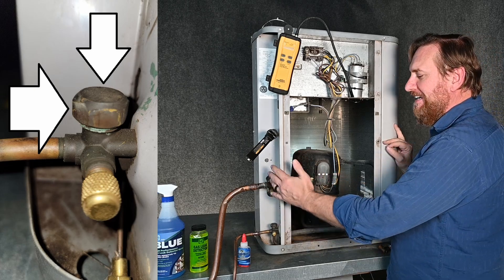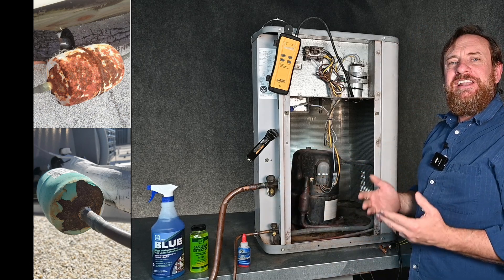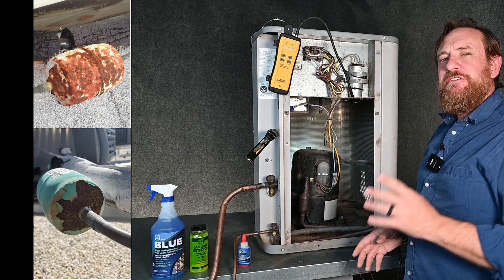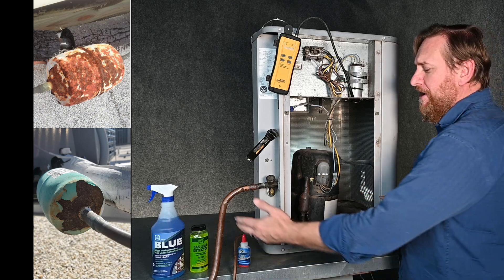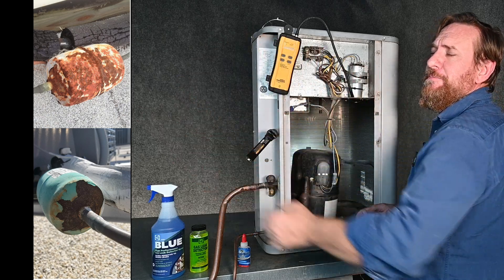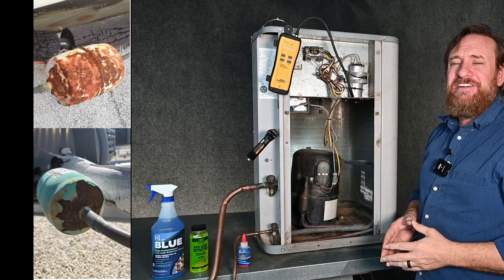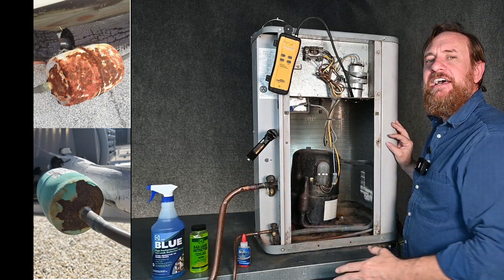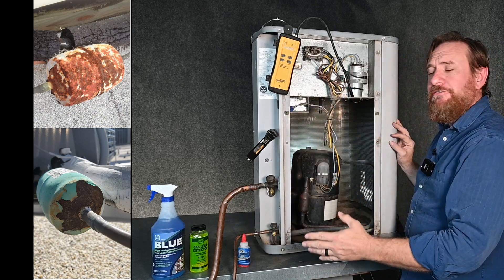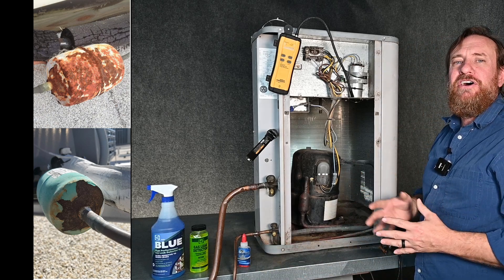So some simple things like that are a great starting point. Now while we're already looking at this point, let's see what else is nearby. A lot of times you're going to see a liquid line filter dryer located right outside. That liquid line filter dryer is made of metal and it's out in the weather, so you're looking at rust building up on those. The ideal location is before the metering device inside the house, but you see a lot of them on the outside. So that's a great starting point — get my electronic leak detector and start checking if it's leaking, then you can take your choice of bubbles and see if you have any forming anywhere on that liquid line filter dryer.